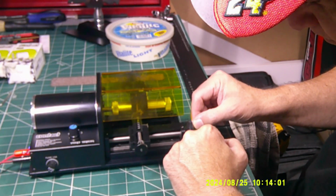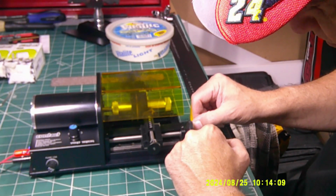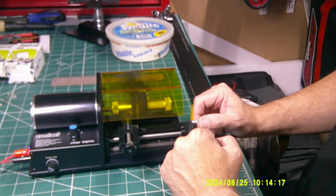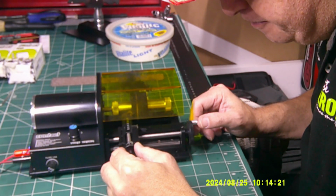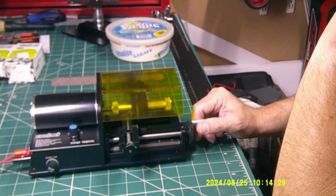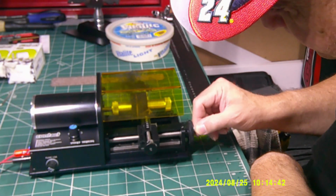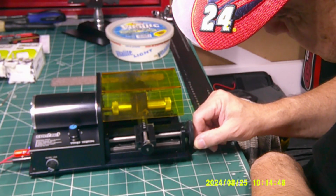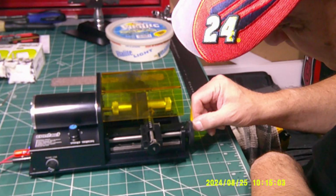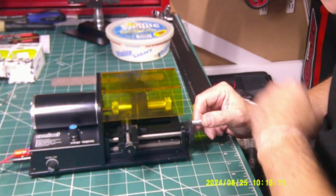You can smell the rubber. So that should be, if I measured that, it should be more 43. I'll go in again. 0.4. So that now should read something like 42.8, something like that. And here it's still taking some rubber off. So we're going again.